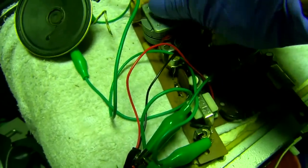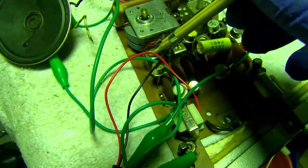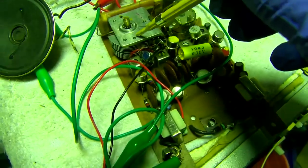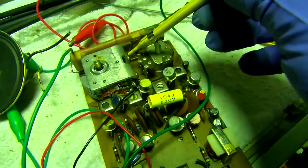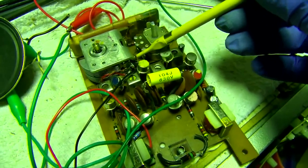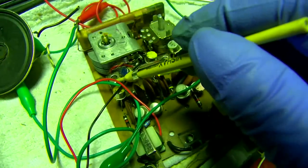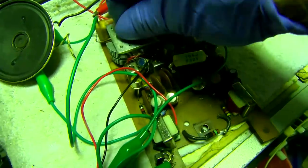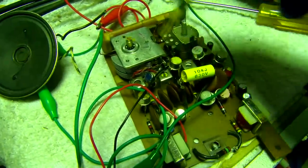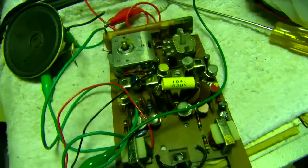So, this should adjust. You adjust this. It's 600 kilohertz. You use this to adjust the bottom of the band. You use this to adjust the position of the top of the band. Then you sort of peak this at the top of the band, the trimmer capacitor. But this, you rock back and forth to find the most sensitive at the bottom of the band, and you just kind of go around in circles. What's going on here?